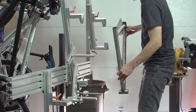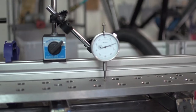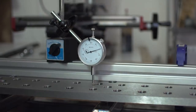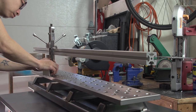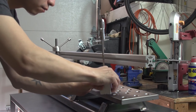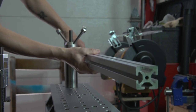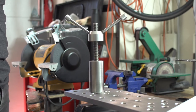Before we get started, I need to scratch an itch. One of you guys sent a message asking if the table bent from the last time I used it, and this has been on my mind too, so I decided to test it. I put the height gauge on there and ran it across, and the plate is indeed still flat. To double check, I put a piece of extrusion into the bottom bracket post, clamped it down, and took a measurement. It's a little low because of the weight of the extrusion — it was sagging down a bit. So I flipped it and took another measurement, and it's a little low again by the same amount, which is great. All is well.